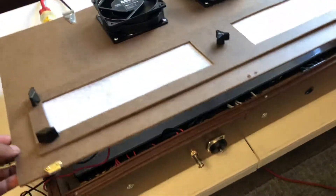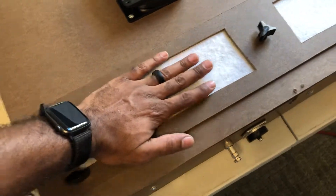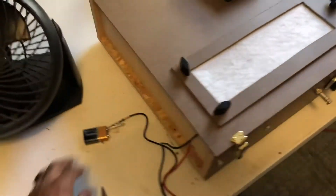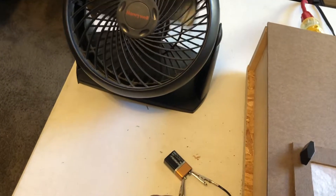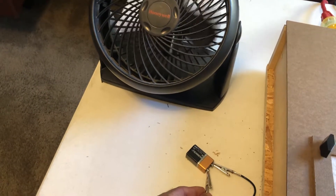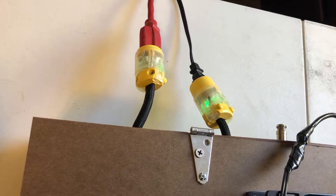Got it powered up. You can actually feel air moving in — that's good. Feel air coming out too. This pump connection is hooked up to the water pump for the spindle. So when the controller sends the signal, the pump will go on. Here's a quick demo: power on, power off — pump on, pump off.